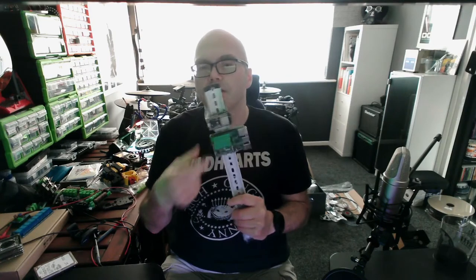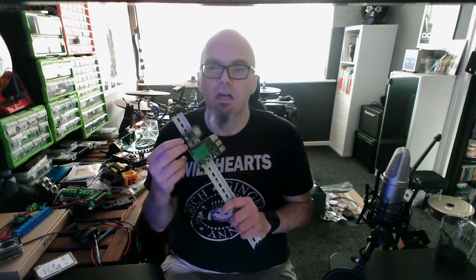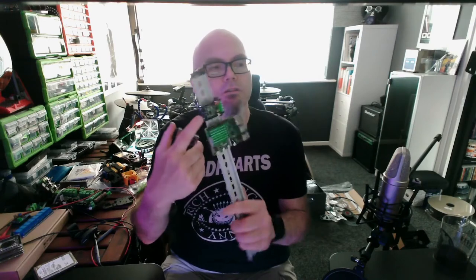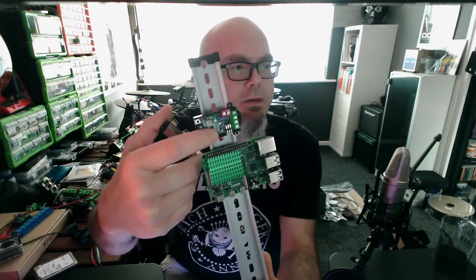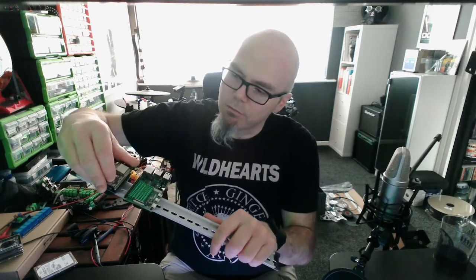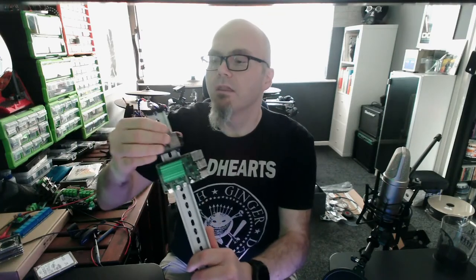So I've been attaching these bits to the printed DIN rail mounts. This obviously is your Pi. I bought the big old heat sink so hopefully the Pi's famous cooling issues won't be too much of a problem. This is actually a board by someone called Quindor. He runs a really good channel, which I'll link in the description. This is his Quindor quad board. You buy literally the blank PCB from China, then you solder on all your components and the buck converter. So you feed your 24 volts in this end, the buck converter steps it down for your little ESP32 board, and then you've got four ports at this end and a common ground over there that you can then drive four independent strings of LEDs off or whatever.